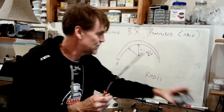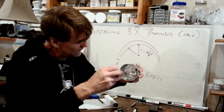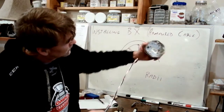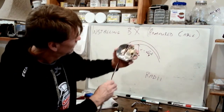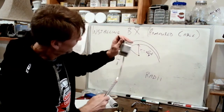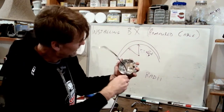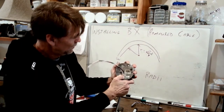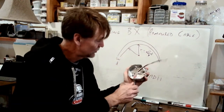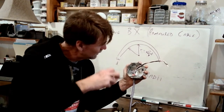Okay, so I've got a device box here. I feel like I need to back this off a little bit. I'm going to shove the wire up in through there. And what we need to do, very much like with the NMD, we have to ensure that that bracket is going to be hanging on to the outer jacket and not the inner conductors.